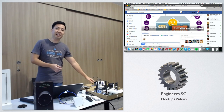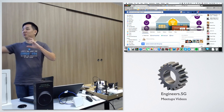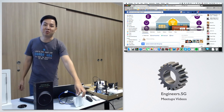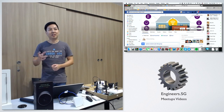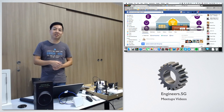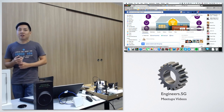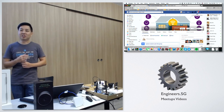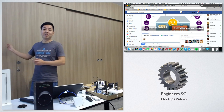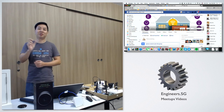If you want to use a relay, it's because you want to keep your existing plastic switch. It works with a regular plastic switch that you see around here as well. Unless you want it for aesthetic purposes, then people usually choose this because it looks nicer, but there's not much difference in terms of operation. Most light fixtures will have space for the relay to go in, most of the new houses, yes. In the old houses, let's say HDB, they have this plastic box that protrudes out of the wall. That kind is not sufficient. You need one step bigger for it to fit.